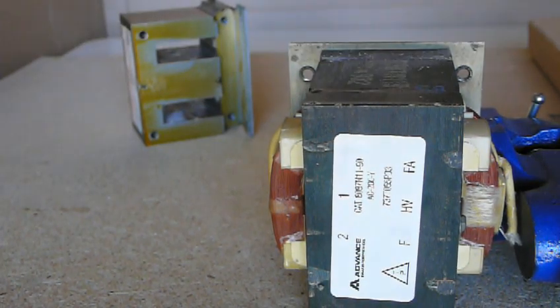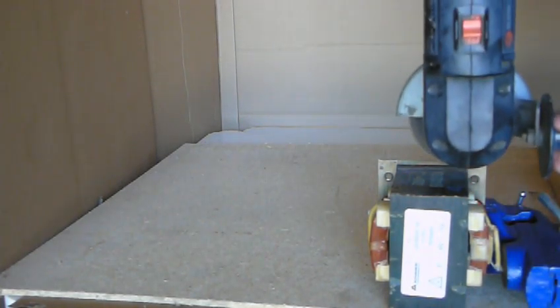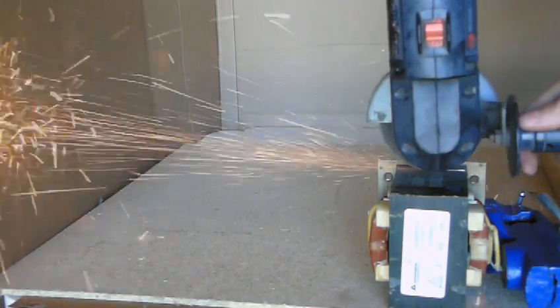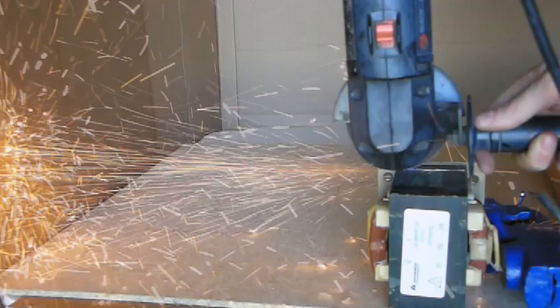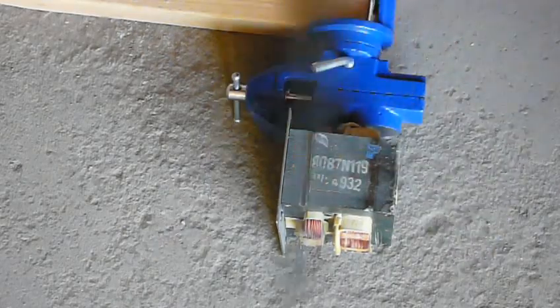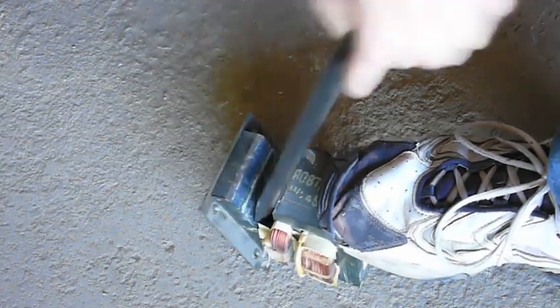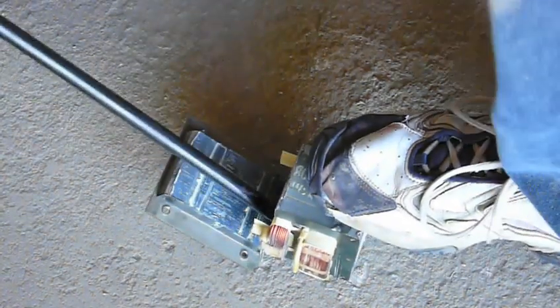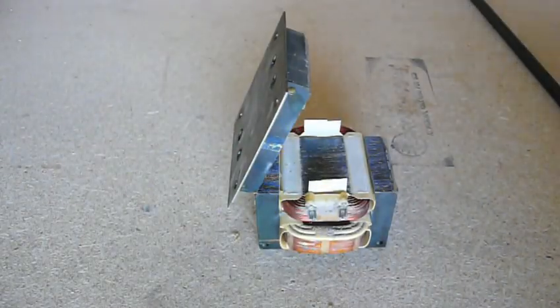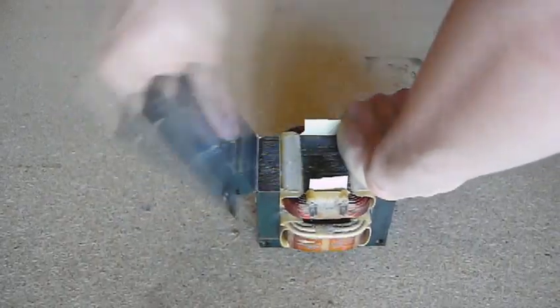Just use an angle grinder. The only tricky part is to make sure that you grind in a straight line directly over the E-to-I seam. You don't want to go too deep, but do make a little bit deeper cut on the corners where the weld is a little bit thicker. Then put it on the ground, get a tire iron, put it into the crack, and give it a twist until you hear it separate. If you don't have a tire iron, you can use a screwdriver, or a block of wood and hammer at an angle. Once you get the crack, pry it open until it's all the way open, then put it on a table and finish it by hand. You can see just how thin those welds are — a sixteenth of an inch thick at most. Now your transformer frame is open.